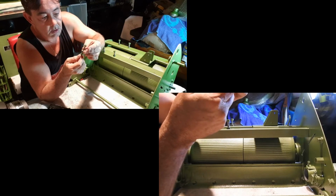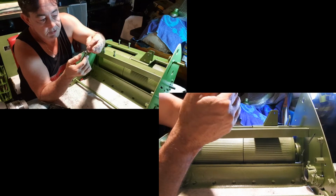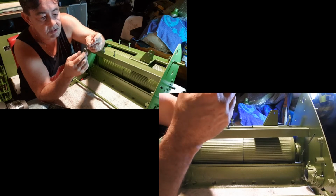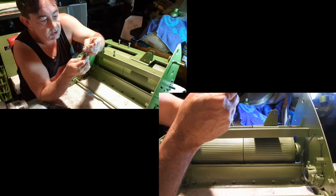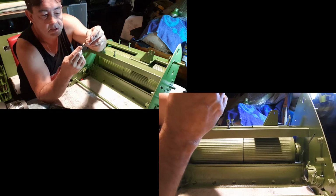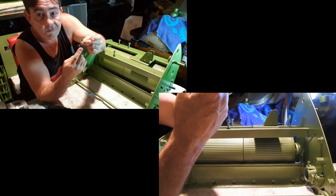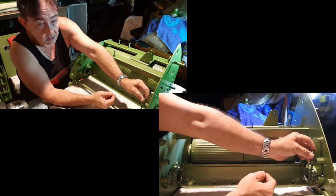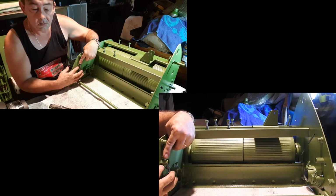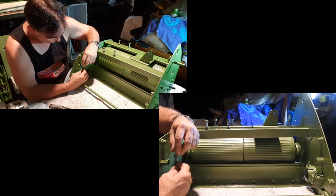Okay, next we've got these parts here, the adjustable part. Best advice according to these is use two washers. Wasn't him, it was SB Renault's. And the other tip I got on these that I thought was great was to get this lock nut, nylock nut, a fair ways up. You can actually then have a look at it in relation to this piece here, and as long as it goes between one washer above and one washer below, and then you've got your nylock nut below that, then you're going to be okay.